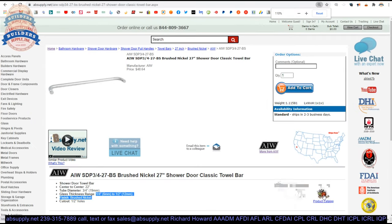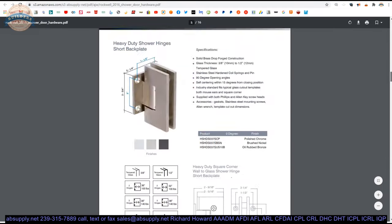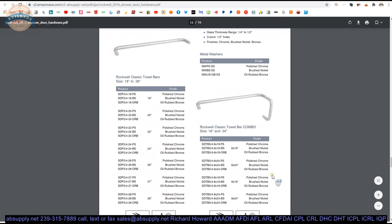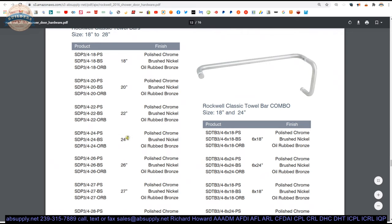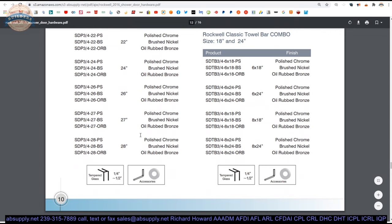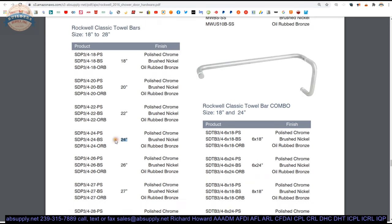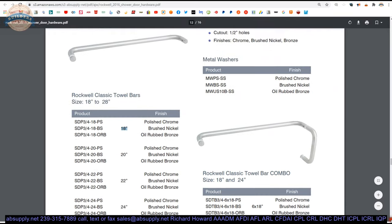There's a link below this video to the product catalog — this is the manufacturer's full line catalog. Here are all of the sizes available in these towel bars. The most common is 24-inch, 18-inch is the second most common. Sizes like 20, 22, 26, 27, 28 are very uncommon in residential work. When it comes to commercial doors, push bars can have any center-to-center — 29, 31, 33-inch are all very common. If you're looking for a towel bar, expect it to be 24-inch, possibly 18-inch, but note that other sizes are available from the manufacturer.